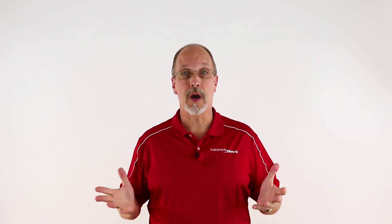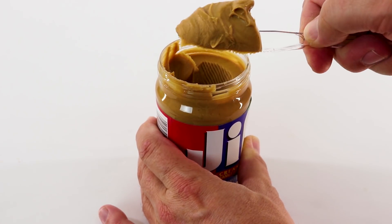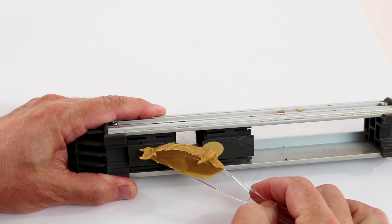Now, in an emergency, when you run out of your sonic grease, what can you do? Well, in a pinch, and depending upon your environmental conditions, you can run over to the local drug store and buy a tube of lubricant or Vaseline. Not the best, but this has even happened to me. While traveling, I checked in my portable ultrasonic flow meter on the airplane and, unknowingly, the TSA removed my tube of sonic grease from my luggage. Needless to say, I was very surprised to discover I had no acoustic coupling when I arrived at the job site. Well, fortunately, it was lunchtime at the water plant, and I MacGyvered the solution by borrowing a jar of peanut butter as an emergency alternate to a sonic coupling. Again, this is only for an emergency.